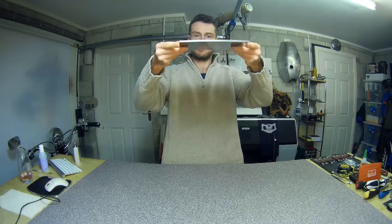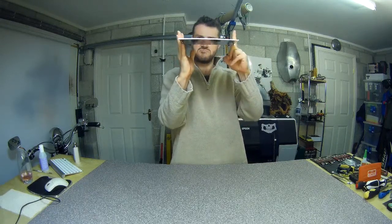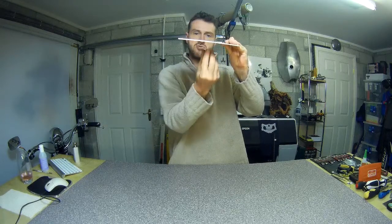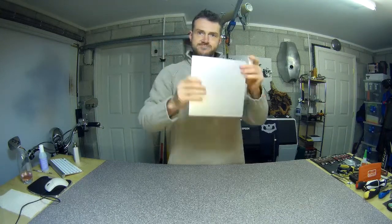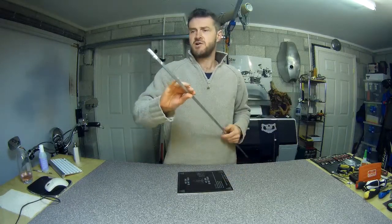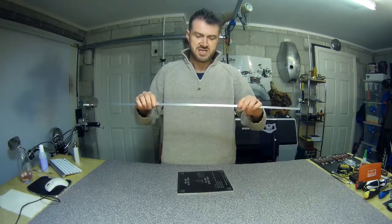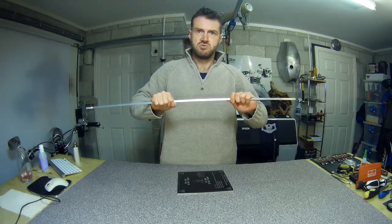Luckily, the way it's going to be mounted, it's bending up on the edges so the middle is a bit lower than the edges. That's quite handy because if I put something at the right level in the middle and on each corner and do it up, it will pull it flat. So the plan is to use a piece of 5mm square aluminium bar — that's probably the best way of doing it, nice and uniform. If we bolt this down and then bolt the bed to it, should be all good.